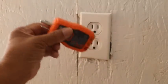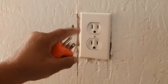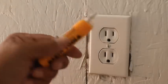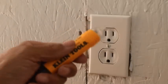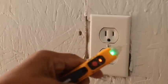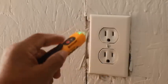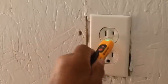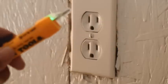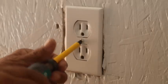But here's the thing — you never want to rely on just one device to make certain that an outlet is not hot before you work on it. And that's why I always test twice with a different device. This is a non-contact voltage tester. I'm going to turn it on here. I've got a green light, and if it turns red, that'll let me know that the outlet is still energized. So let's just check this. You want to insert it into the outlet and we're looking for a red light. No red light — so we're good to go. Now I can safely work on the outlet.